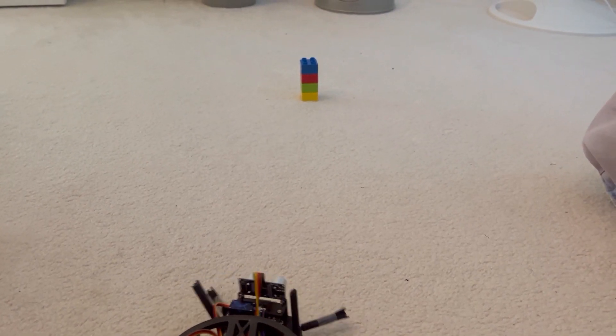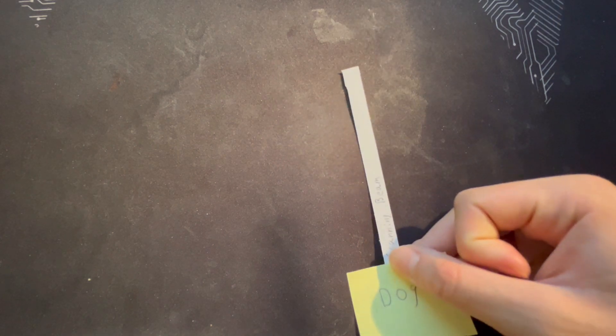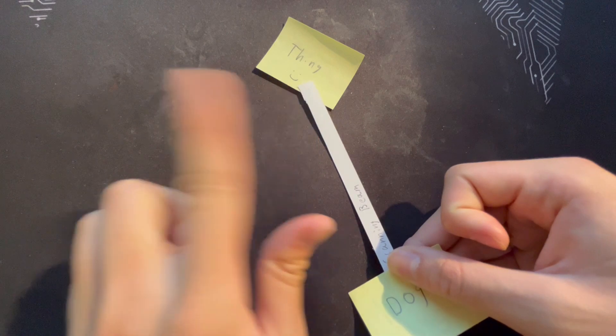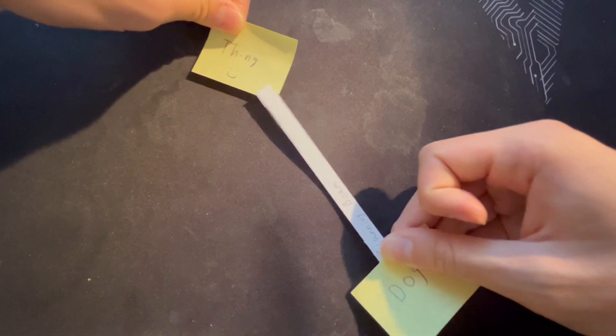The method of tracking a stationary object by scanning three directions got me thinking: can we track a moving object? As we near the last of our criteria, one of the nice-to-haves is the ability to follow people or objects that are moving. I applied the same concepts in a new way. The seeker head would step left or right by a few degrees — if the distance gets smaller, it continues moving in that direction. Eventually it reaches a point where the distance starts getting bigger, so it moves the seeker arm in the opposite direction. The cycle continues and the seeker arm oscillates left and right by a few degrees from the closest point on the object. We then take the servo angle and turn in the direction the seeker arm is headed — and we track the object.